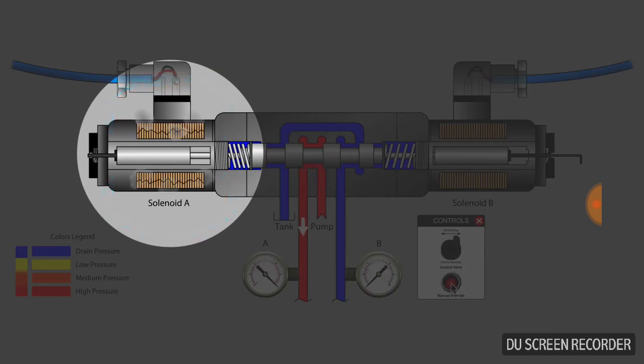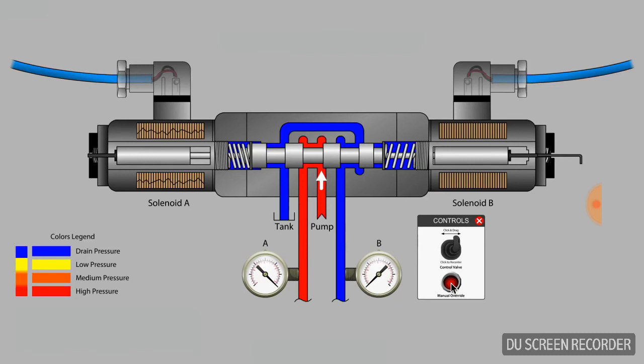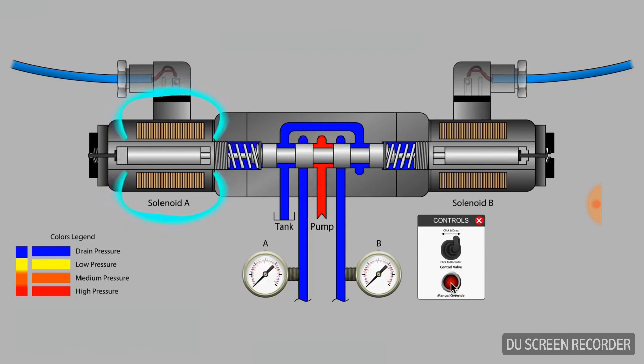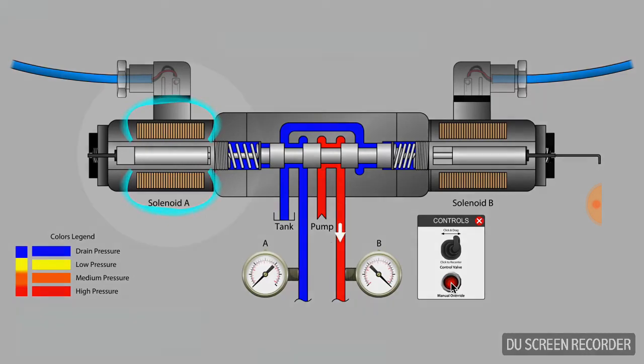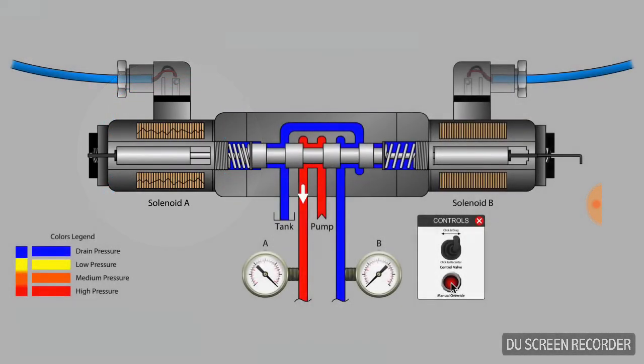in solenoid A is being pushed outward from the coil's center position, increasing the size of the magnetic field, which in turn increases the amount of current running through the coil. Holding the armature in that position for an extended period of time may cause the coil to overheat and open the winding. The internal coil wire is now broken.